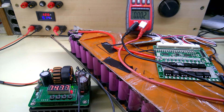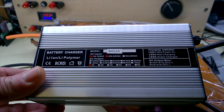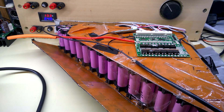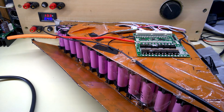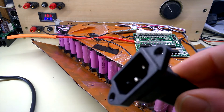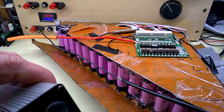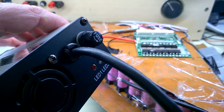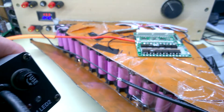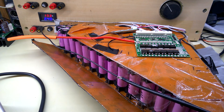I need to check if all the banks come up to about 4 volts each. At 84 volts that's a 2-amp lithium-ion charger — I plugged it in via the output lead into the battery connector, and nothing happened. Looking at it further, there's a fuse on the end — I don't know if it's an input or output fuse — but it had blown: an F5A quick-blow 5-amp. I replaced it, plugged in, and it instantly went pop and blew the fuse again.